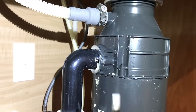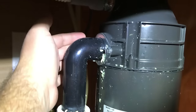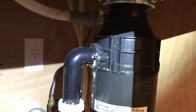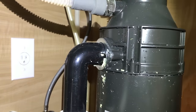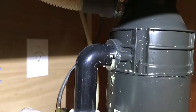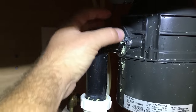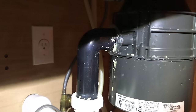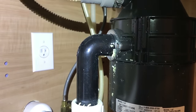To get this started I'm just going to use a regular flathead screwdriver and loosen the two screws — there's one on the right and one on the left side. You saw all the water that's currently up in the sink above, so it's going to be quite a bit of water that escapes once that loosens up. Make sure you're prepared — have your towels down and a bucket at the ready. The idea is to loosen it just enough so you can gradually pull it away and let the water slowly escape into the bucket, so you don't have one massive gush of water all over the bottom of your sink.